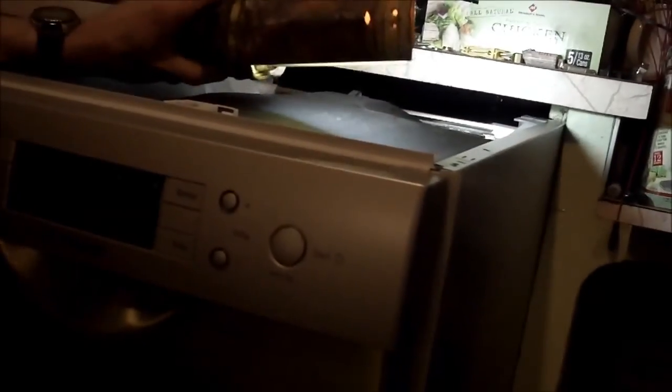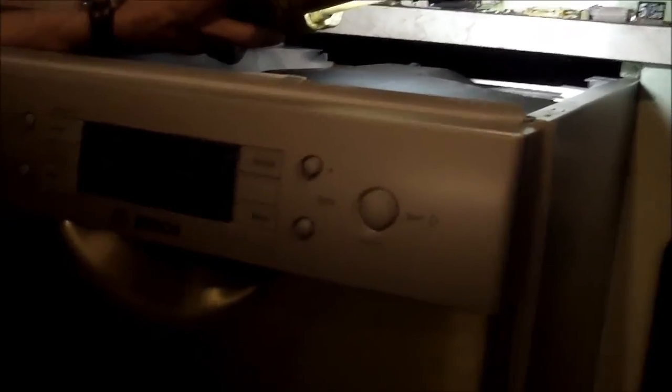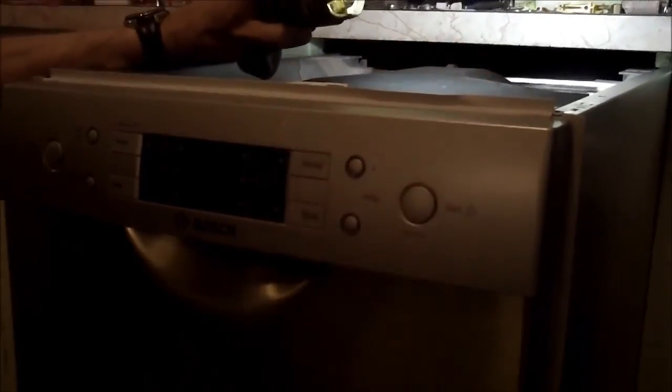Okay, so I've got my screwdriver in the black hole down there, which, by the way, has also got a hex on it, and that hex is metric as well. I tried a 3/8 on it, and it's probably a 12. But as you can see, it's just dialing right in just as perfect as ever. So now, since we have a pretty good idea of what we want on the back end, we'll take a level and we'll level the front levelers until that bubble comes in.